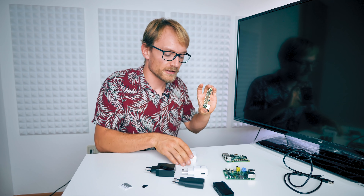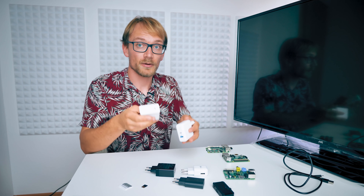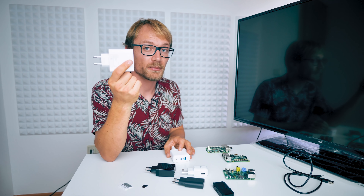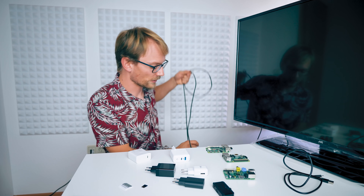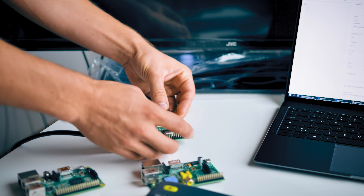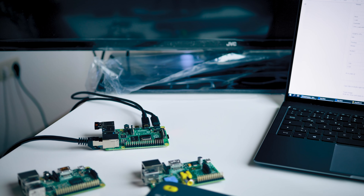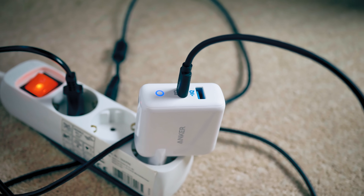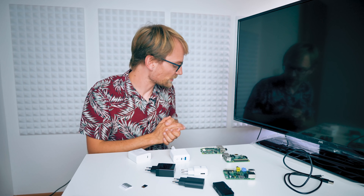I also wanted to check whether the Raspberry Pi 4 could run off a USB-C power delivery supply and USB-C cord. I tried two supplies: an Anker and my 60W power delivery Huawei laptop supply. Using a USB-C to USB-C Choetech cable — the same one I charge my laptop with — the Raspberry Pi 4 was fine: on first plug-in it booted straight away, no issues whatsoever. It may not be to USB spec but it works — it charges my laptop, it powers the Raspberry Pi 4, it charges my phone.